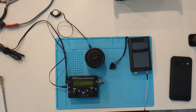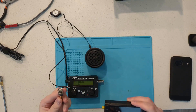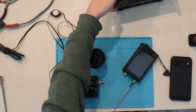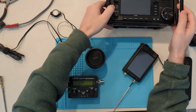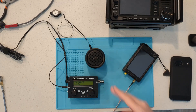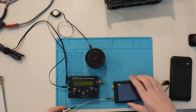You've got multiple options to do this. The best option I recommend is to pick up a TinySA Ultra. Another option is a Nano VNA set right next to the radio. Another option — probably what most people will do — is take your radio, hook it up to a dummy load placed right next to the radio, hit the transmit button, and use that as your tone generator. But for ease of use we're going to use the TinySA Ultra.